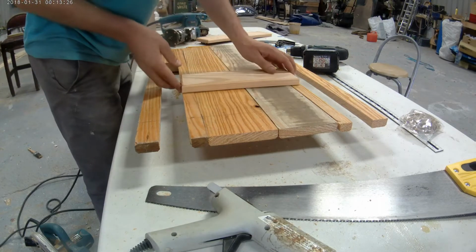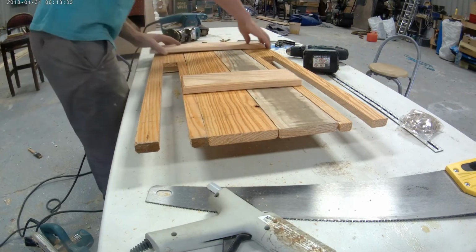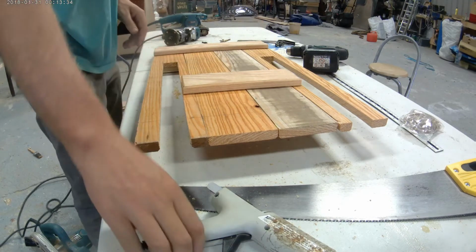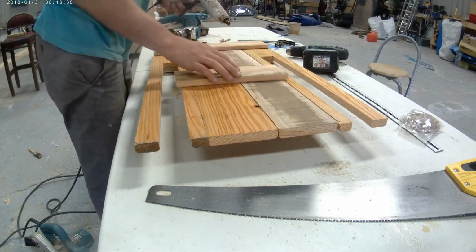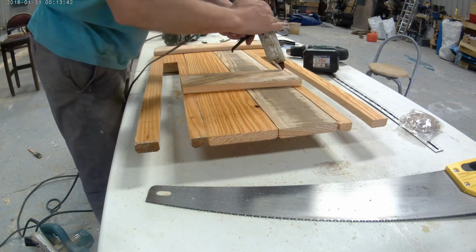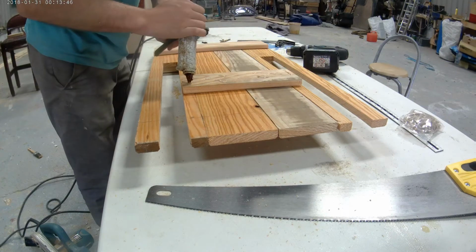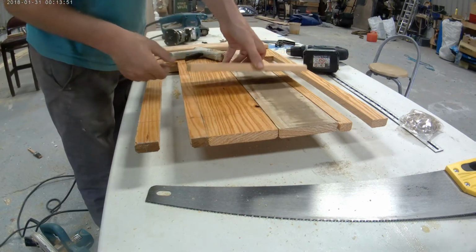Okay, so I've already made up these 2 backing pads. They're made out of larch as well. All the floorboards are larch. And I've also taken all the sharp edges away from these backing pads using a router. I'm also gluing these down with the hot glue gun, which just makes it so much easier to screw into.